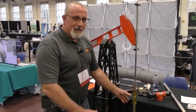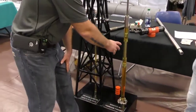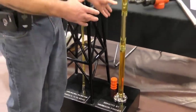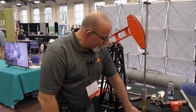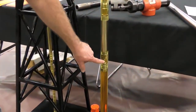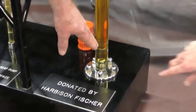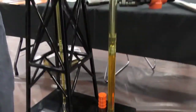This is actually a clear version of what a pump would actually look like. This is all the way down here. This would actually be seated in the tubing in a seating nipple down inside the tubing. You'd actually have your plunger here, this would be your pump barrel, you'd actually have a cage here with a valve in it — this would be your traveling valve — and then you actually have another valve seated in the seating nipple, which would be your standing valve.